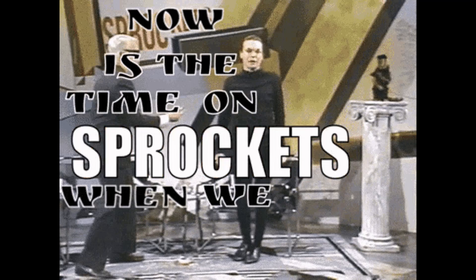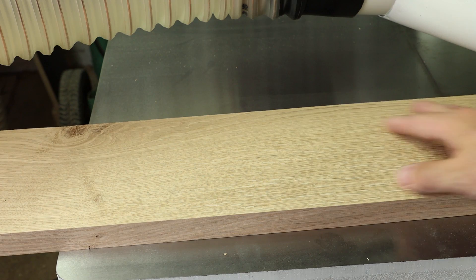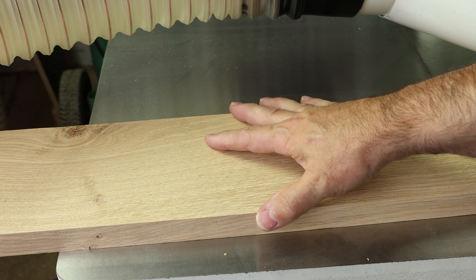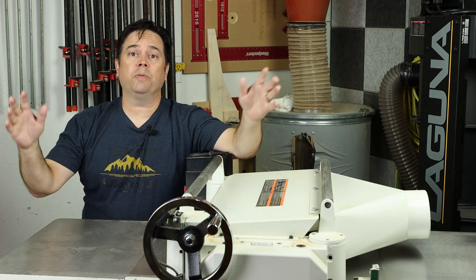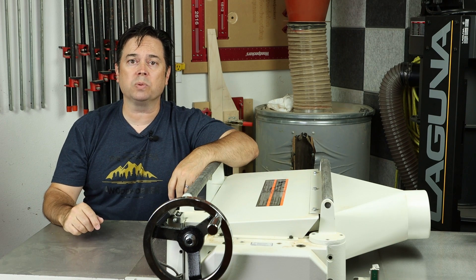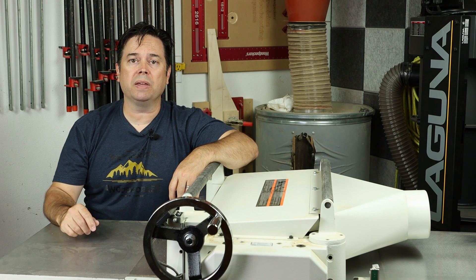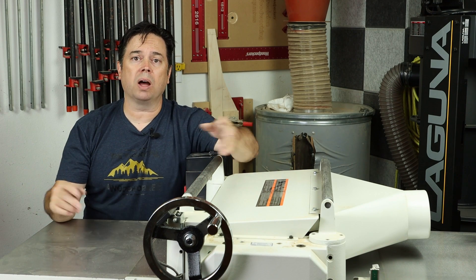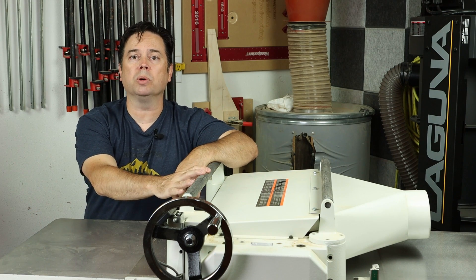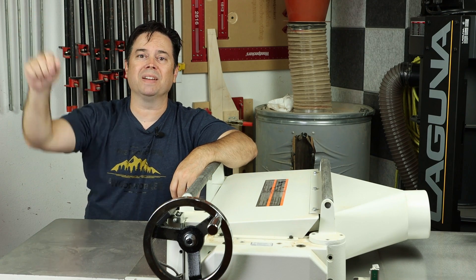Now's the time on Sprockets. So far so good — I haven't seen any tear-out at all on the figured lumber I've run through the planer since the gear reduction. I'll keep you posted when I get a chance to put some wide panels through. Hopefully my little experiment with a gear reduction on this planer will give you some insight as to whether you might want to make that swap yourself. If you're running a 15 or 20 inch Jet or Powermatic planer, it's likely you'll be able to make an easy swap with direct factory parts. Remember to subscribe to the channel, and if you want the update on how well this mod worked, hit that bell notification button. Thanks for watching and we'll see you on the next one.